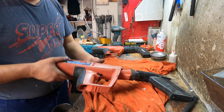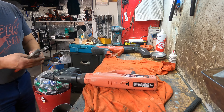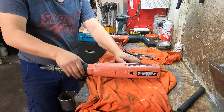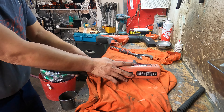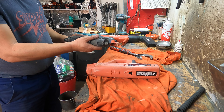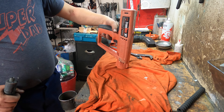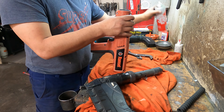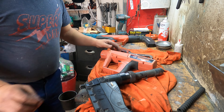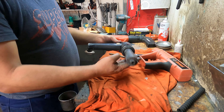The Hilti gun and the Ramset are all similar. To undo this one you work from here and I'll show you inside. I've been cleaning and servicing it already. For the outside and inside, if the triggers work, all you do is apply degreaser, get a little toothbrush, go inside, scrub like this, and blow it out.